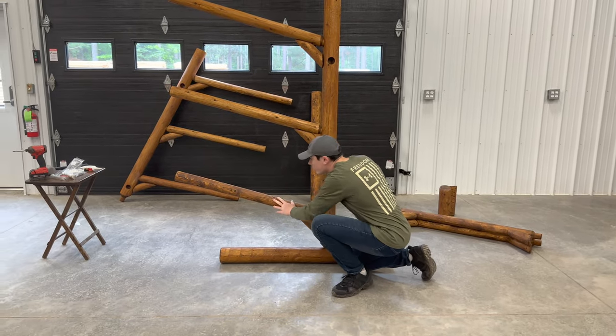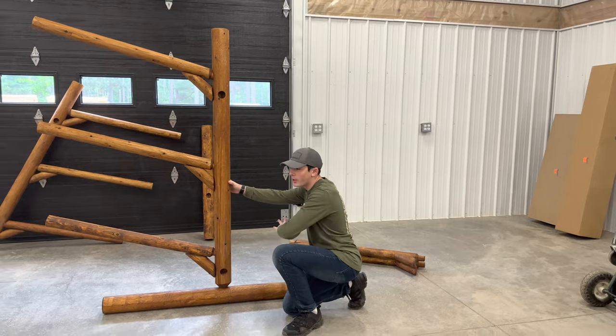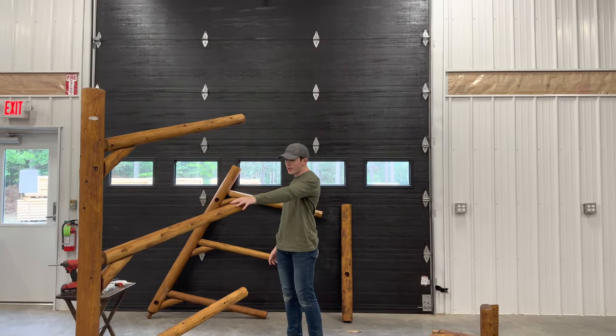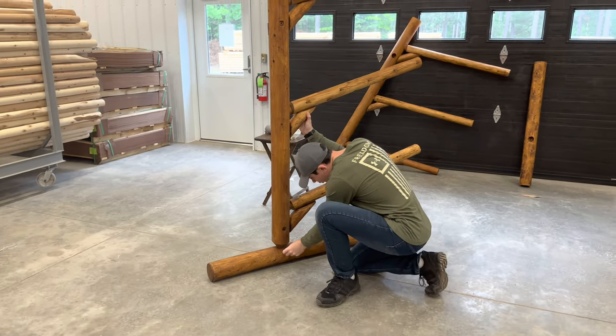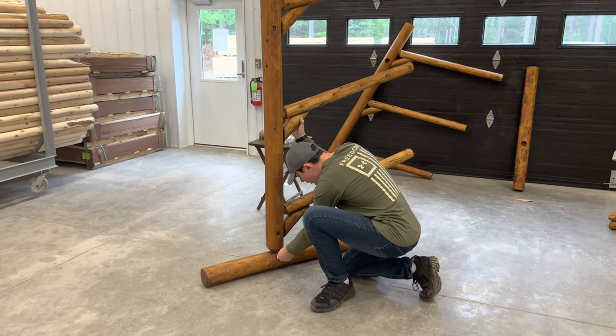side of the foot is on the arm side. The short side has no arms on it whatsoever. So you're also going to want to make sure the foot on your rack is straight. So you're going to want to take your 3-inch GRK screws, where there are pre-drilled holes on the sides of the feet. You're going to want to put them in there.